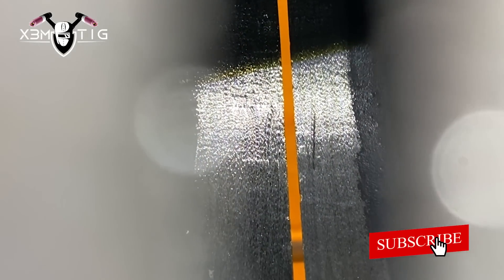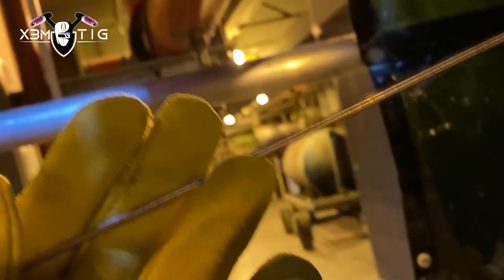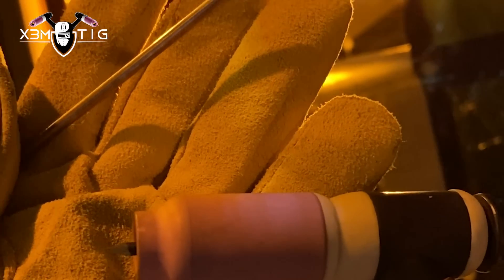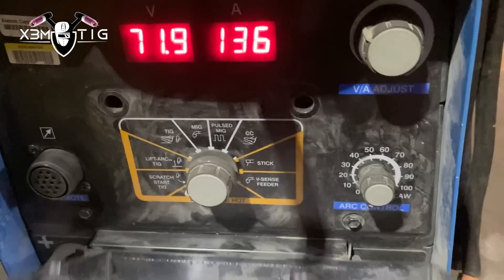This is on the top tack, the over-root tack. I got one on the top, one on the nine o'clock, and one on the bottom six o'clock. As you can see, the prep inside is nice and clean. Always go a couple inches from that edge — prep is 50% of the job. You want to have a really good prep, guys.